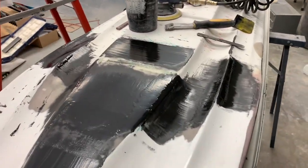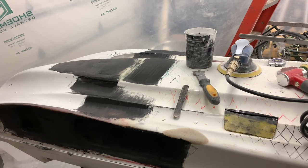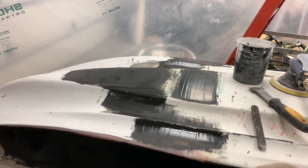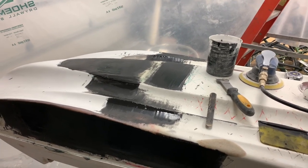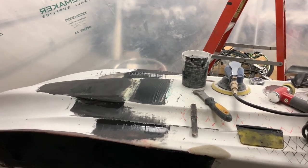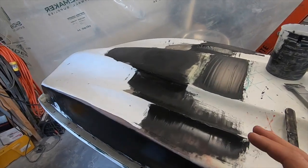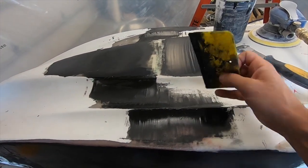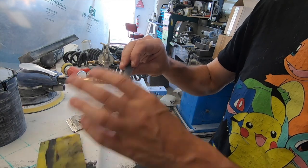I'm kind of worried that it won't harden just because I've never done this before, and every time I work with a new material I'm worried that it won't harden. I mixed it according to the ratios on the containers as recommended for the 3M microspheres. This was 80 grams of epoxy with almost 6 ounces of microspheres by volume and then 2.5 grams — well it was supposed to be 2.5 grams but I used 2 grams of the pigment. I think I shot a clip with my iPhone after I put this stuff down, and the good news is that it did harden. I haven't tried to sand any of it yet but it seems to have pretty decent bonding characteristics.